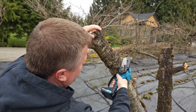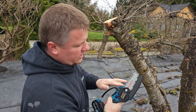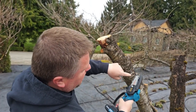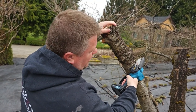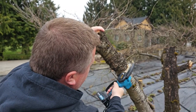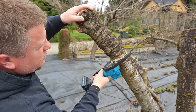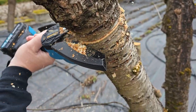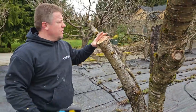Keep your downward pressure like this. This part right here is a good feature on the saw — not all saws in this size come with it. When you start cutting it spins in this direction, so it will pull you forward, and if you don't have this point to rest on you'd have to constantly hold it with your hand. This is a nice feature. And yeah, that was an easy cut — not an issue. One cut down.